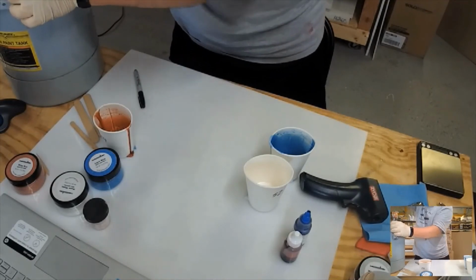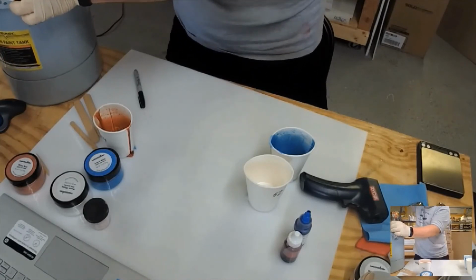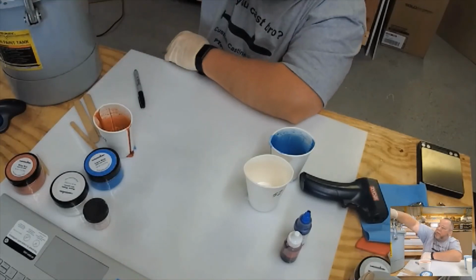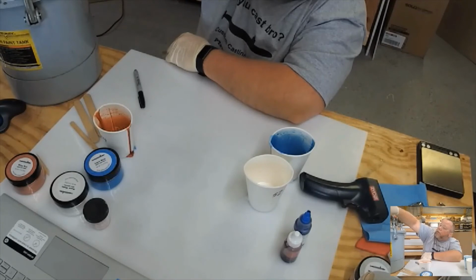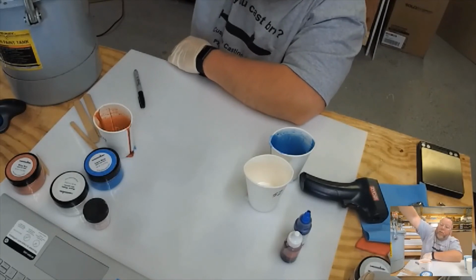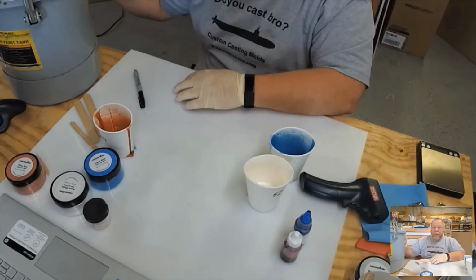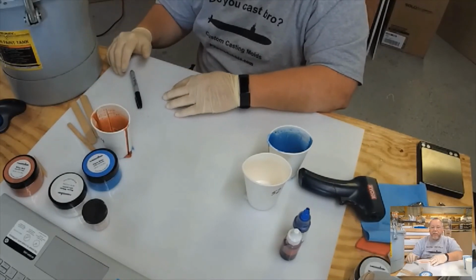And the pressure that I go to, I said, was 35 to 45 pounds, right? So, all right, all four sides are tight. So now I'm going to fill it. All right, there we go, 40 pounds. So we'll come back in a little bit, and I'll demold, and we'll see what kind of casting we got.